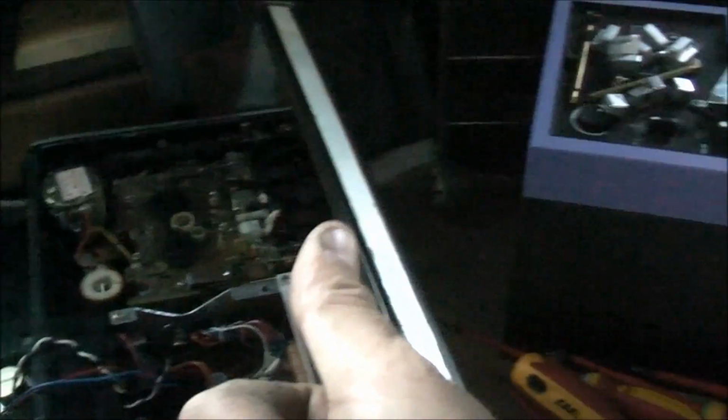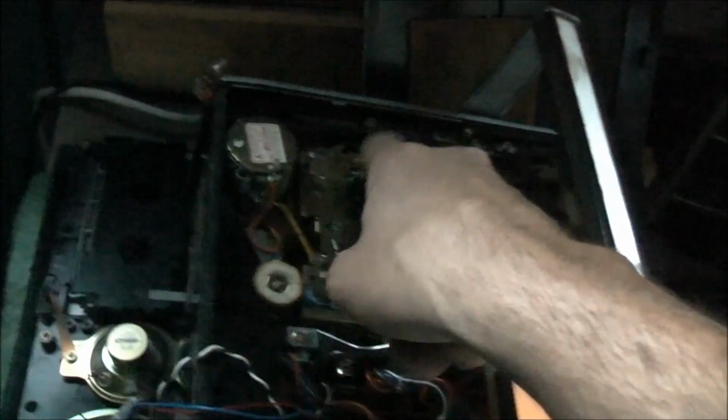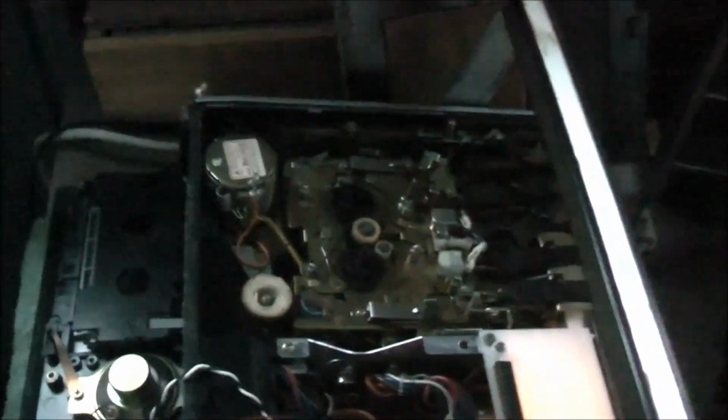I had to take the motor out and turn it with the pliers on the shaft, and add dabs of sewing machine oil in there, or 3-in-1 oil. That got it sorted, but it's a bit slow and underpowered. That motor's tired. I've got the Pye York Boombox working well. The wheels on the take-up and fast forward, the grease and the glue, that's all been fixed. So that Boombox works good.